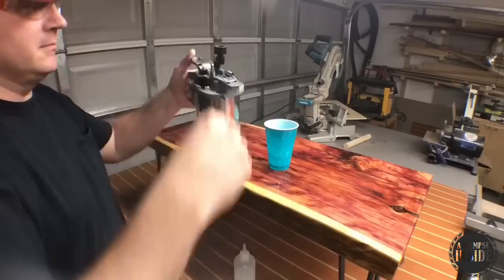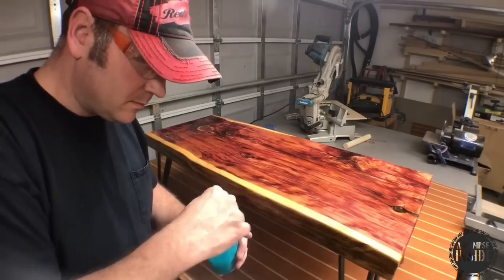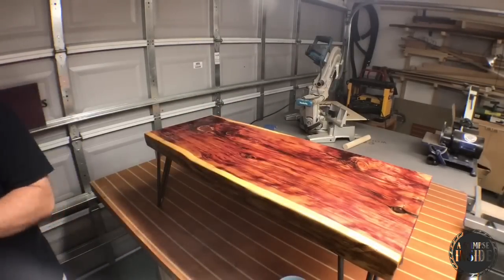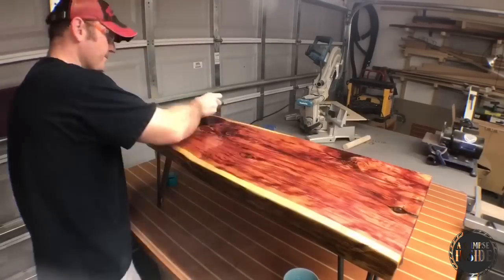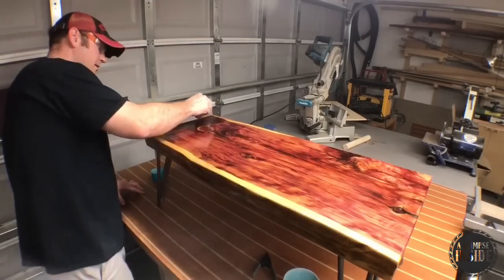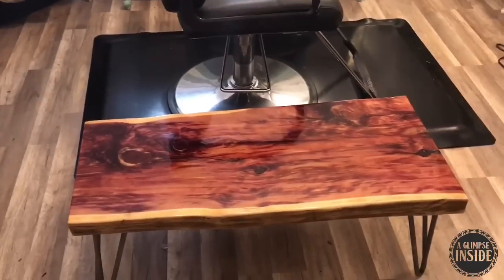I like to use my new favorite gadget — the pancake syrup dispenser for your polyurethane. I have that 50/50 mineral spirits and polyurethane mixture ready and I'm going to make my own custom applicator: a piece of t-shirt with a piece of shop towel on the inside, clamped shut. It's a little too tight so I end up just using my hand to apply it. I'm going to put this in a dust-free environment — I don't think my wife's going to mind if I take this table into her salon. Yeah, it should be just fine.